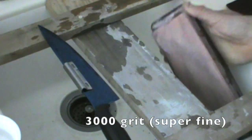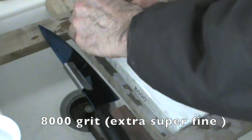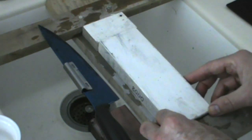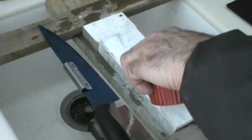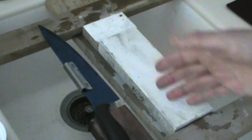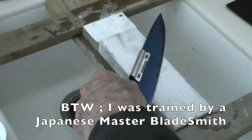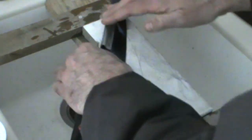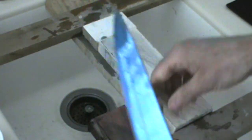That was a 3,000 stone made in Japan — super high quality. I'm moving on to an 8,000. 3,000 and 8,000 is what I like for this application. I put a little spacer so it fits just right. I'm going to put a little bit of water on this stone as well — no magic tricks. The water helps remove the steel and it keeps the stone cool. That's it. The clip, perfect angle — here we go, heel to the tip. I've done even strokes on both sides.